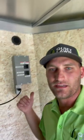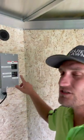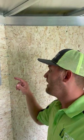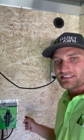Here is the main piece — the distribution box. It holds two 20-amp breakers. The two rear outlets are on one 20-amp breaker, and the front outlet is on its own 20-amp breaker. We also have the mower charger up top, which is a 240-volt 20-amp breaker, and that powers the charger which charges the mower.